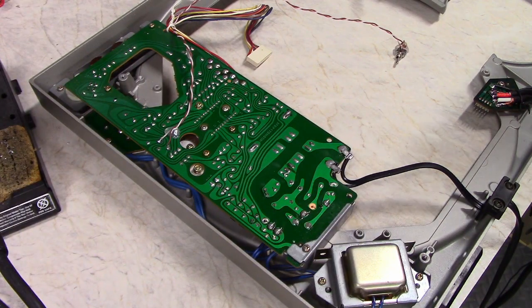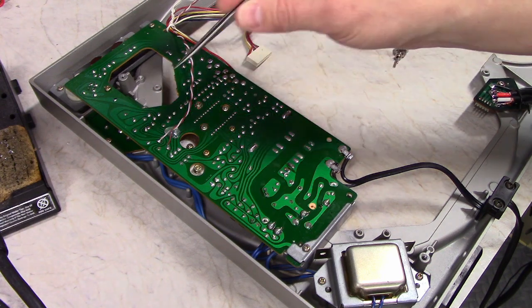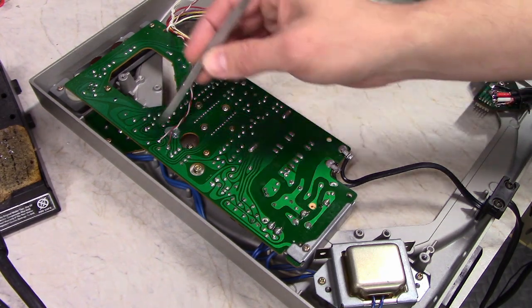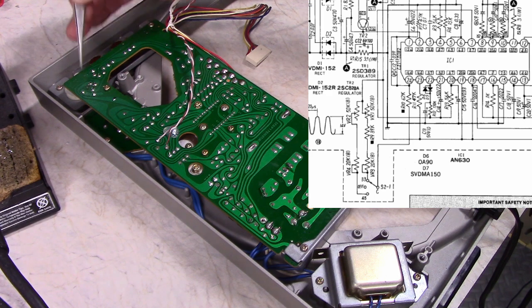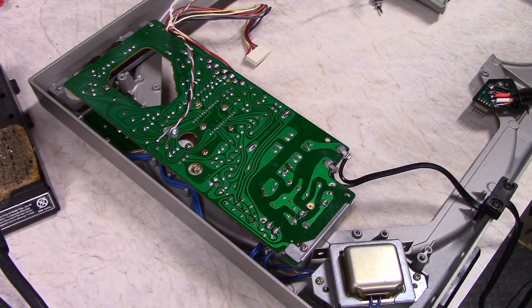I've performed the mod here — I didn't shoot the soldering, but I'll explain how it all works. Basically the motor controller works like this: pin 1 of the IC generates a sawtooth waveform, and that goes through a series of resistors and capacitors and gets fed back into pin 24 of the IC. Depending on the resistors in the chain, it will determine the speed of the platter. The only difference between the 33 RPM speed and the 45 RPM speed is the switching in and out of R9, which is a 39K resistor. So 39K of resistance added slows you down from 45 to 33. Taking out 39K gets you up from 33 to 45. If you do the calculation you'll find you need to take out another 44K or so of resistance to get up to 78 RPM.